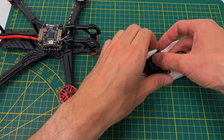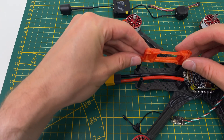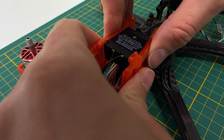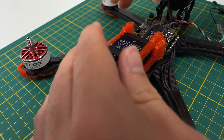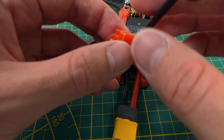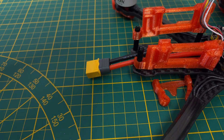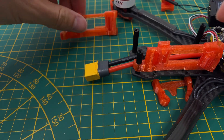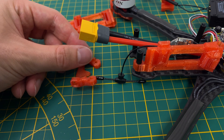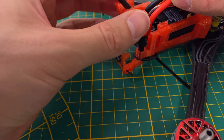Let's unbox the DJI O3. I have chosen this system because, in my opinion, it delivers some of the best images. Mount the air unit in the rear section using the 3D printed TPU parts. At this point I have to admit that I forgot to orient the XT60 connector upwards, so it's time to disassemble everything and also reposition the receiver, which I also forgot. After a lot of back and forth, I also ended up replacing the antenna because it was simply too long for mounting in the rear.